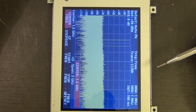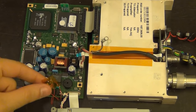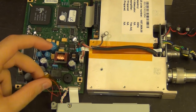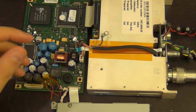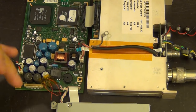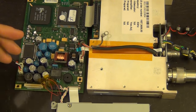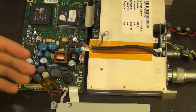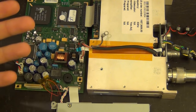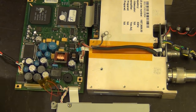Now the only other thing I need to do is clean up the case and close it. But I need to decide what to do with this MOSFET - I'm touching it now and it's quite hot. The reason it's running hot is this one has a much higher R_ON - about 1.2 ohms versus the original 90 milliohms. Once I receive the original part I can put it back in properly soldered, and since the R_DS(on) times current determines power consumption, that one should do much much better. But for now it works.